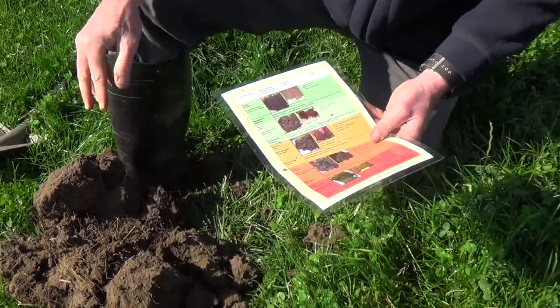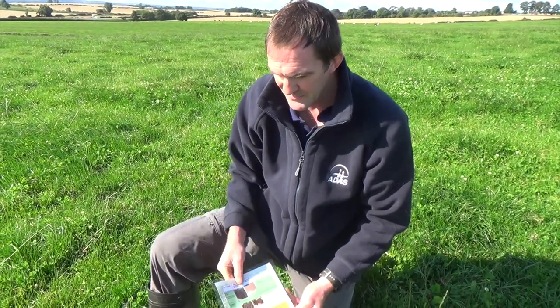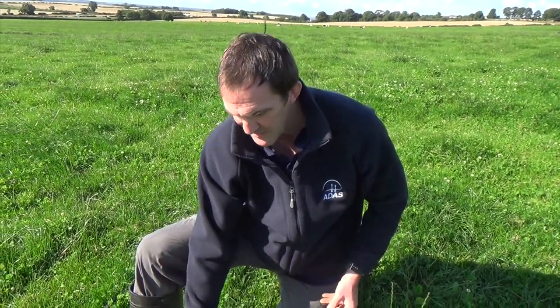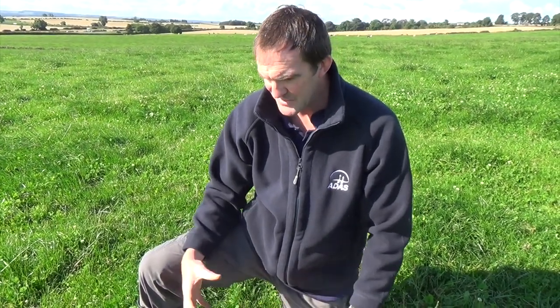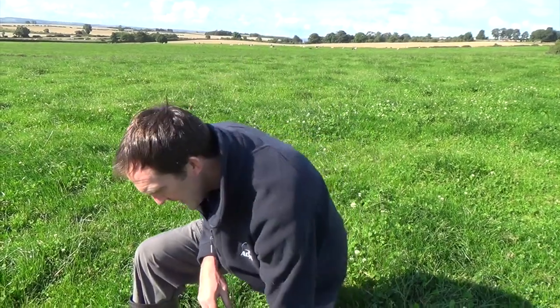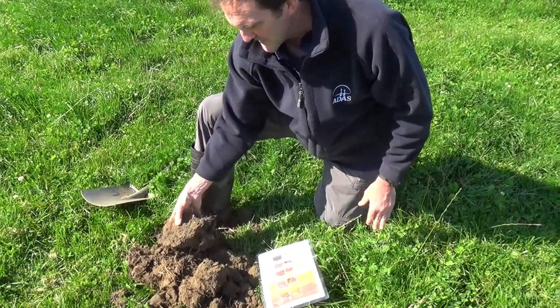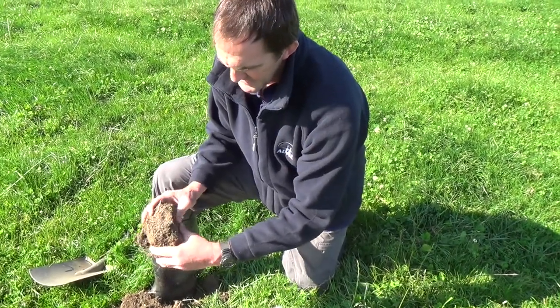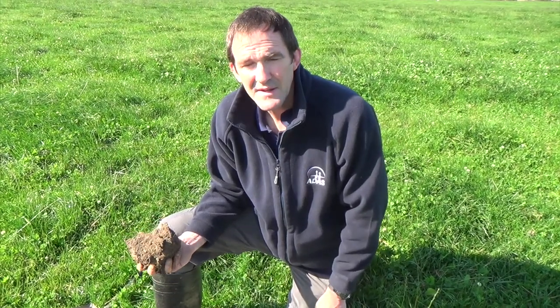This is a soil where you might want to consider using a sward lifter. You'd certainly expect improvements in soil drainage from sward lifting, even if you didn't see yield increases. Improvements in soil drainage imply possibly more grazing days in spring and autumn, better infiltration of rainfall and slurry, and less surface runoff — so lower flood risk as well. The land should be easier to manage if it's better structured, with more vertical fissures through the soil meaning water will infiltrate better. But it's marginally better than on the headland. We looked at the headland first to get a feel for what compaction looks like, and now coming to the middle of the field we've still got a limiting compacted layer with angular aggregates — probably not as bad as on the headland, but you could still consider sward lifting this.